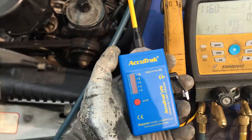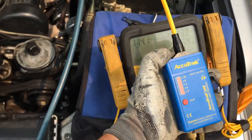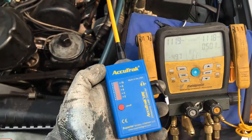I haven't shown you this one yet. This is an ultrasonic leak detector, and on this one here I have it pumped up with dry nitrogen. We had it at 160 psi, it has fallen to 130, then 113, so we definitely have a leak.